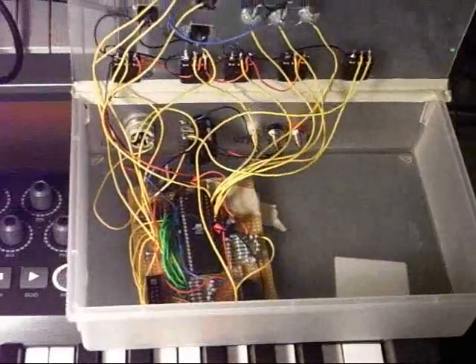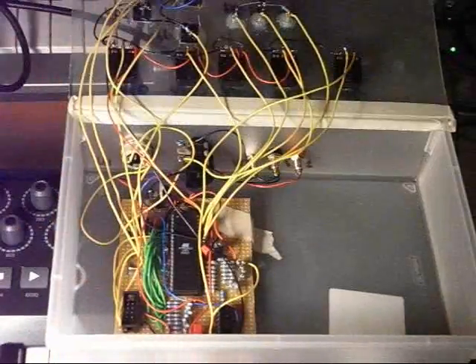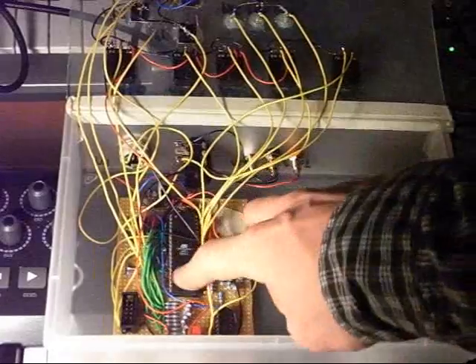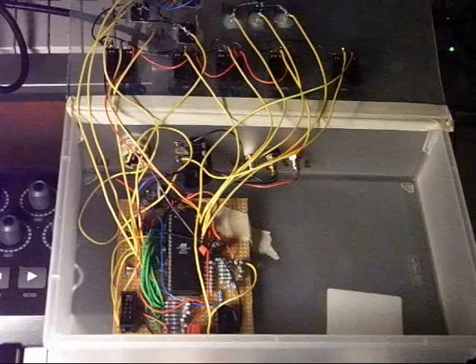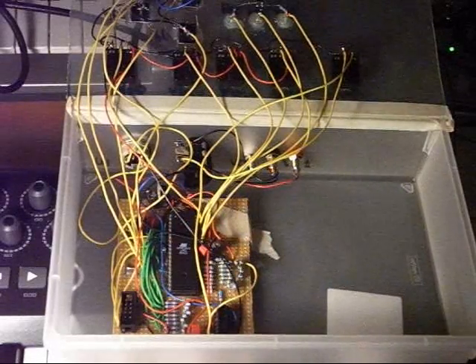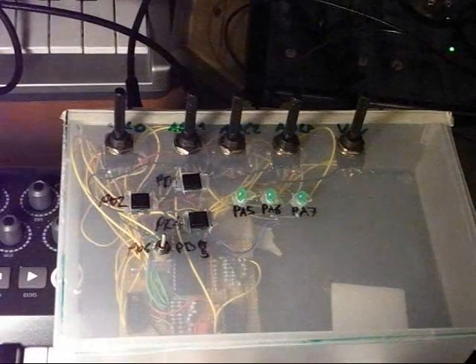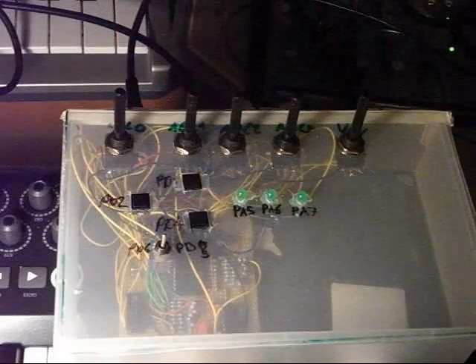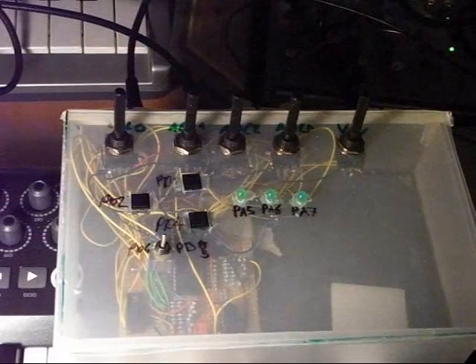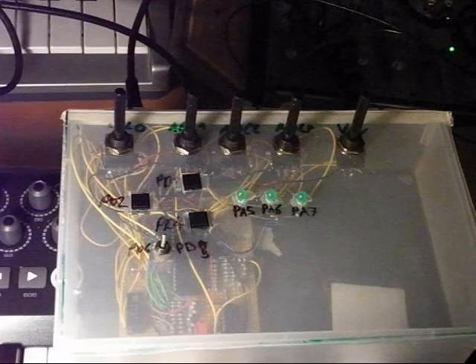Just a quick look at the inside. We have the AVR chip programming interface, and all these resistors here build the digital-to-analog conversion network. This basic version has some potentiometers connected to the analog-to-digital converters, several test buttons, and of course some test LEDs.